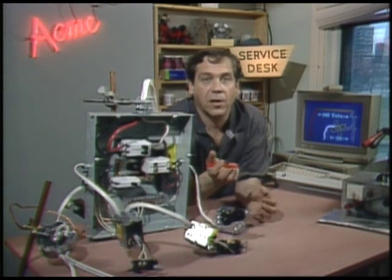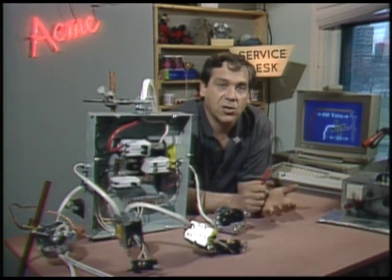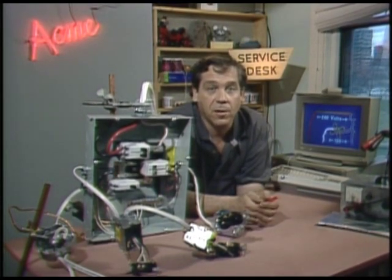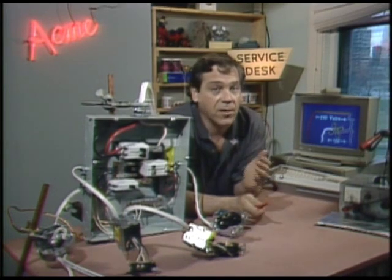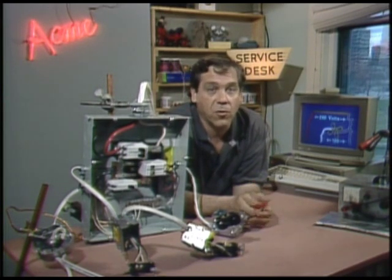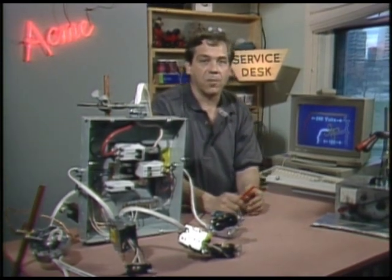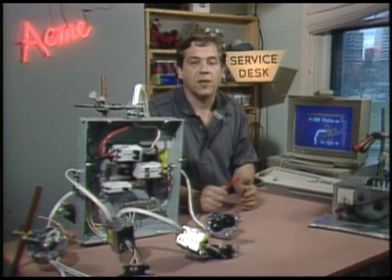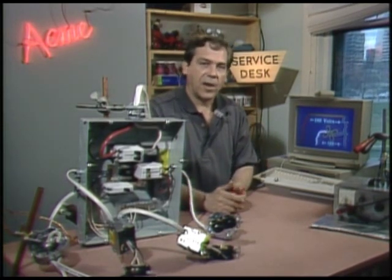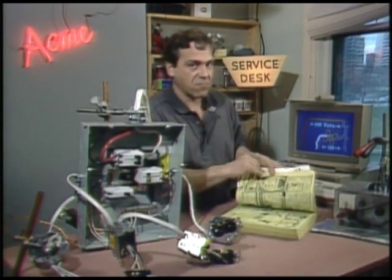The rules and regulations of local electrical codes were created to standardize electrical installations in any given area, but they also ensure that no potentially dangerous situations can occur in a seemingly safe layout. The case of a split receptacle accidentally connected to two fuses or breakers on the same side of the transformer is a great example — it would apparently function normally, but the neutral wire can be forced to carry twice its rated current. Fooling with house wiring can be dangerous for all sorts of reasons. So when someone drops in to do a little weekend work for you, ask them a few simple questions about grounding and the 120/240-volt thing. If they can't answer those questions to your satisfaction, don't let them proceed.